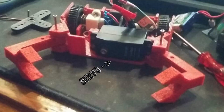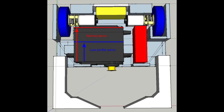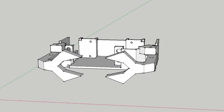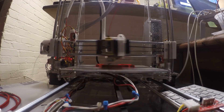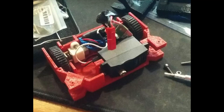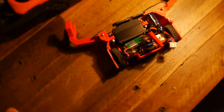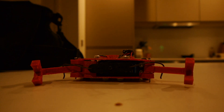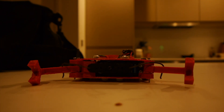The most important thing was a servo. I wanted a high torque servo because, well, it's not going to crush anything, but at least I want it to grab properly. So I went with this Altern low profile servo, just because it gave me more space for the innards. With ant weight, you're only allowed a four inch cube amount of space. So I designed it so that most of the body was quite short, so that there's a lot of length to fit a wide amount of claw space. The claw mechanism is basically the servo horn rotates and it pulls these two metal wires that open and close the claws.